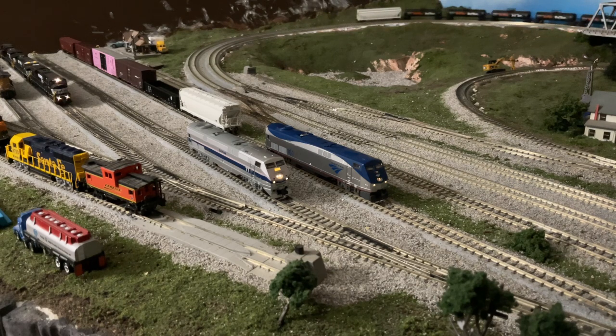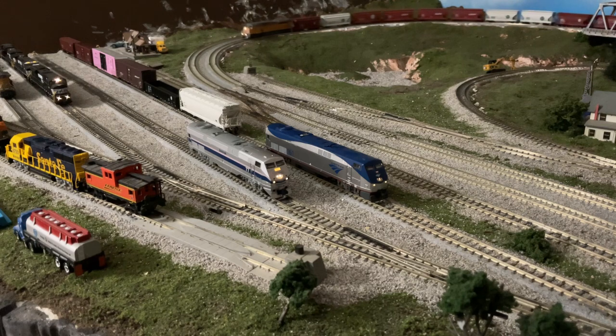CV34, you are going to switch to a value of 4 and that remaps your rear tail light to function 1. The reason why I use function 1 is for the most part I generally don't use the bell. Even on my sound locomotives, usually when you hit the horn you get a bell for a period of time, and that's good enough for me. So for the most part I don't use function 1 on anything, meaning in consist it doesn't mess with the lighting. That is why I have moved my tail light to function 1.